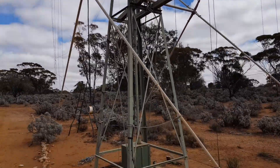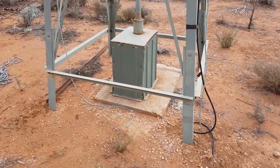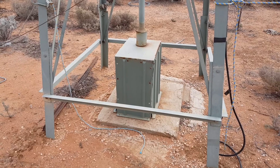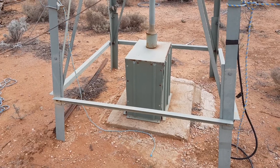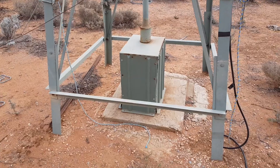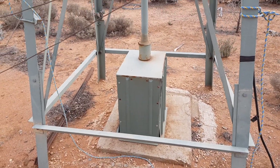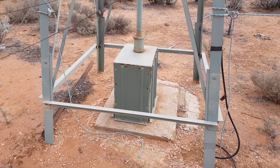The pole is in two sections. Down at the bottom there is a prop pitch motor out of an old World War II airplane — I can't remember the type — but it has a gearing ratio of ten thousand to one. It runs off 12 volts and the cables run underground. I can turn the antenna around from inside the shed — it turns very slowly, but it's better than turning it by hand.